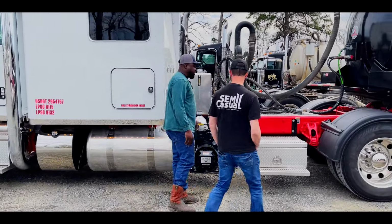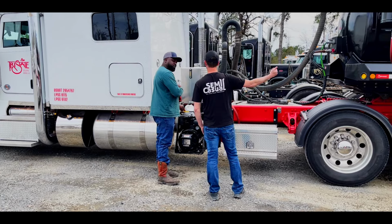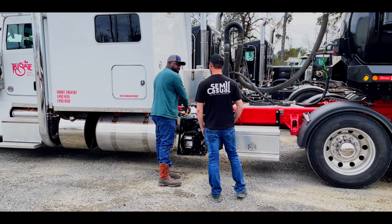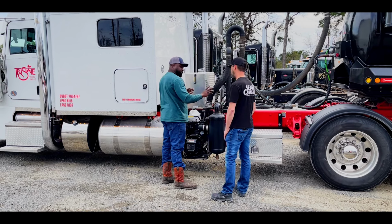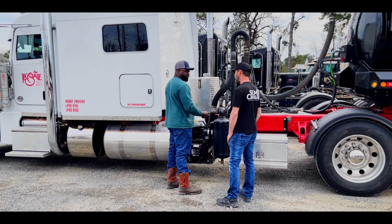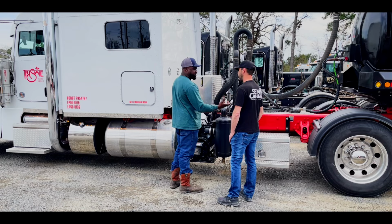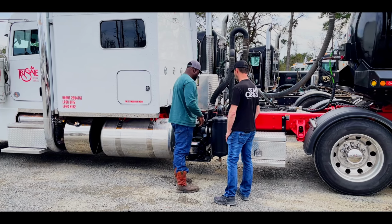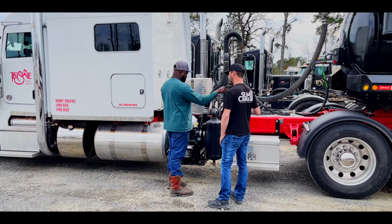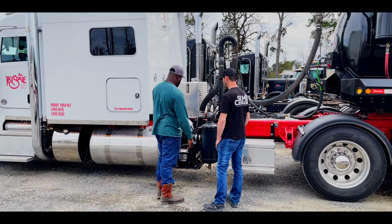Well, this is the vacuum pump for the trailer. Right now it's in a sucking mode, so we can suck if you're going to fill the trailer up. You got to be in this direction here. When offloading, most of the time, if you have water, you don't have to use any pressure for offload. But if it's all base mode, it's kind of thick, so you put it in the pressure out. Push out, unload. So this is what we do.